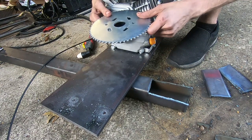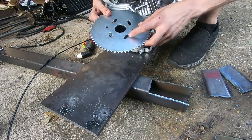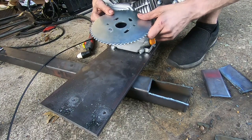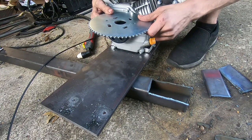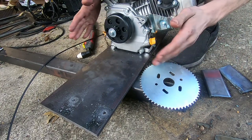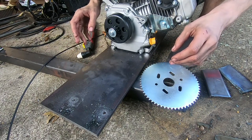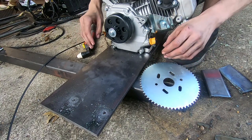We can remove the spacers later if I get a smaller sprocket. And then the front wheels — we'll have to make them adjustable somehow so that we can raise and lower them, because I don't really want this to be raked, I'd like to have it pretty level. I was thinking about making the front adjustable anyway. We're already going to have toe adjustable because the rack gives you adjustability on the toe. But the rest — caster, camber — I don't know how much that will be adjustable. We'll figure it out.